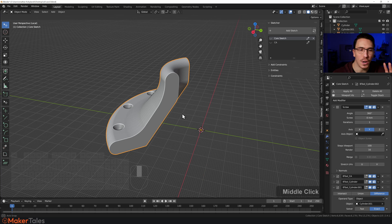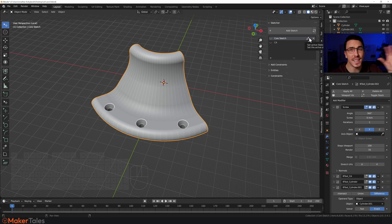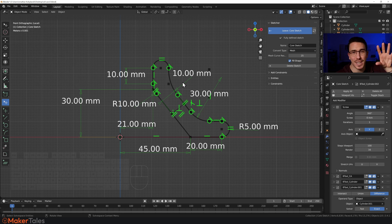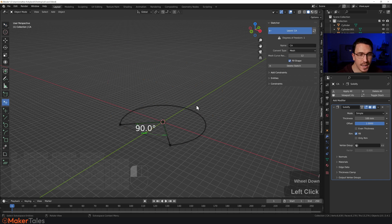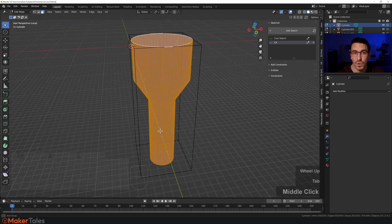The first thing I did was take a whole bunch of measurements, which is when I discovered I need to make the design as parametric as possible, because the feet are different on each side. So this is the first iteration of the holder — a nice, simple design that just does the job. The main sketch is this one right here. I have the technical drawing in the description completely for free. Once I did that sketch, I revolved around it, and then there's a nice big Boolean used as a cutaway, which is another simple sketch. And I've got a couple of simple shapes to represent the screws.